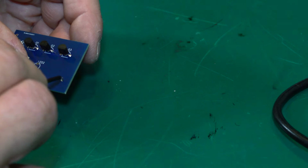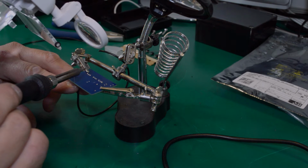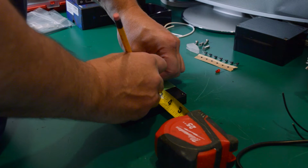Because I designed the holes for the tiny legs of the LEDs, I was unable to fit any wire I wanted, but I found some 22 gauge non-braided wire so that I could connect the LED to the cover of the case. I measured to perfectly center it and made a 3/8 of an inch hole to tightly fit the tiny lead.